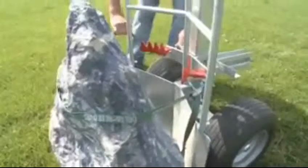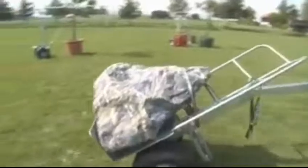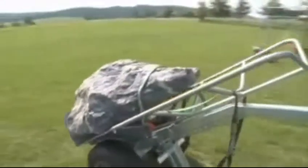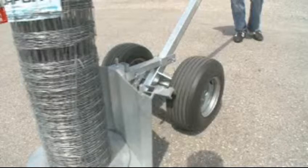For the transport of large stones, for example, the seam gripper has a further function. It is used to hook in the tension belt, which is put around the object to be transported and is lashed. In order to mount the fence winch, first of all the supporting console must be fixed to the transport blade.